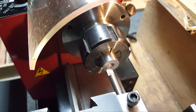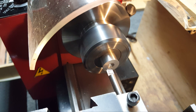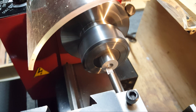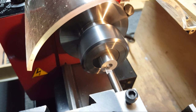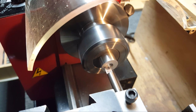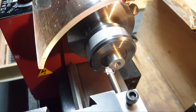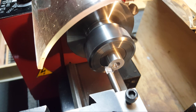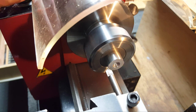Hopefully this thing stays in focus — the camera is mounted on the cross slide. Let's go to low RPM. I can't really see what I'm doing but I think I'm there. Yeah, you can see it — it just takes it right off really nice, and I can go pretty deep. That's an inside chamfer. Let's do an outside chamfer — it does a really nice job on the outside too. I can go pretty deep; when playing around before it starts to chatter but it's a really nice tool. Okay, well that's it folks.